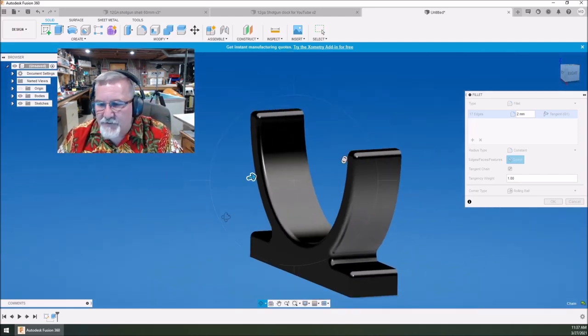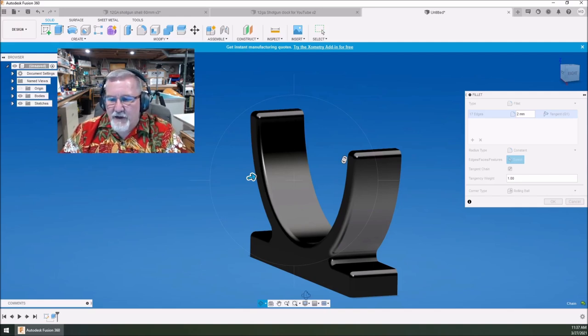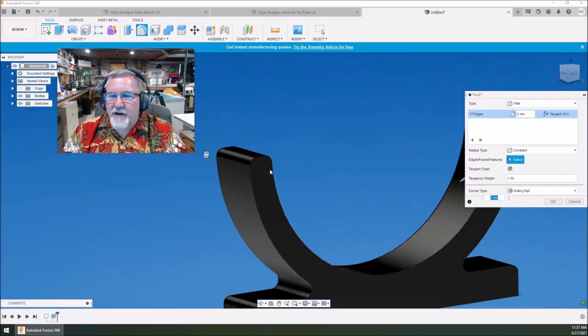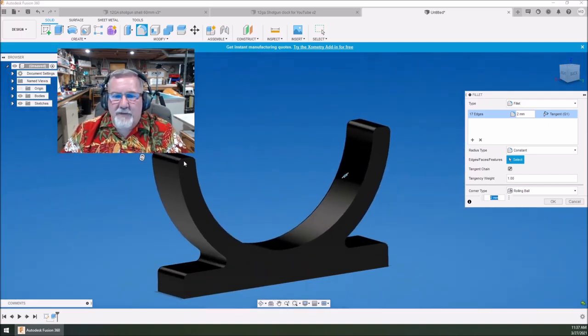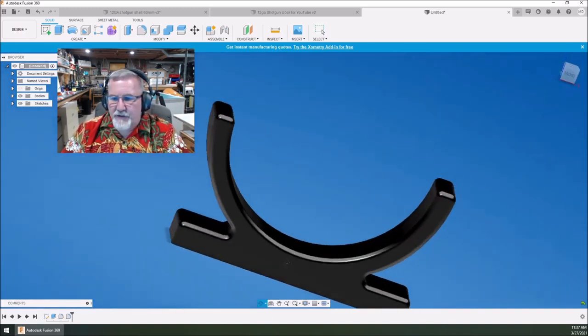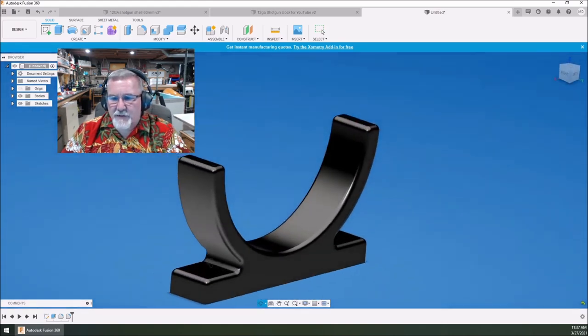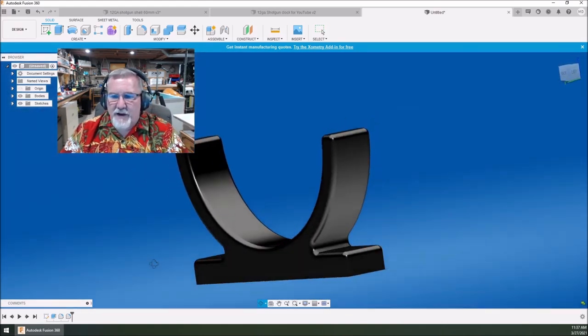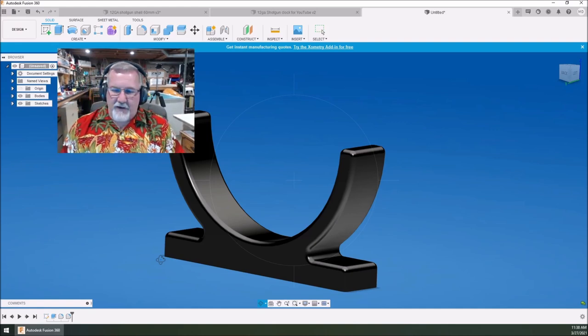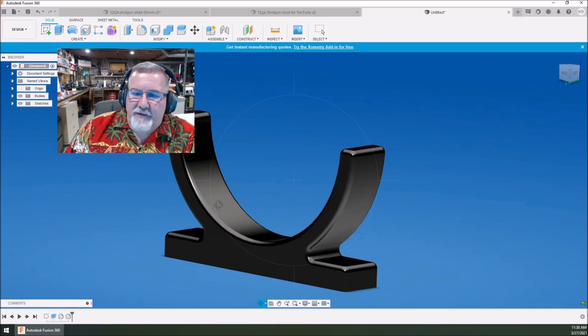I want to capture that for you guys and show you how I change it over. I'm going to do the actual change. On the CR-10, I'm running the copper right now. Looking at the G-code viewer, I'm waiting for this to hit 450. At 450 I'm going to go back up here and hit pause. The cool part about pausing through Octoprint is the bed temperature and nozzle temperature stay on right where you want them.